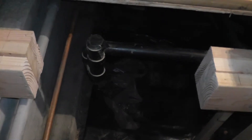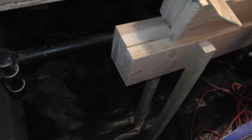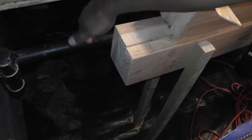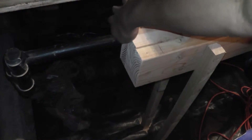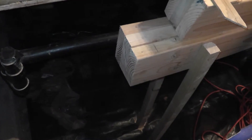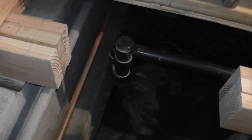Since I'm going to be using joist hangers to attach the cross-members, I cut along the bottom to make the bottom of these joists all flush all the way across. I did that using a circular saw — I attached a straight edge all the way across and ran the circular saw along it. So where the joist hangers will be sitting, it will be flush all the way across, and I did the same thing on the other side too.